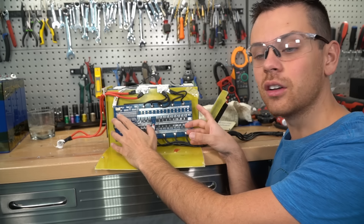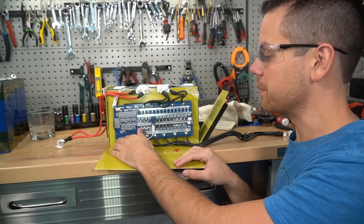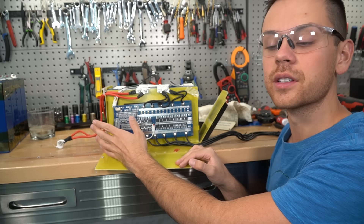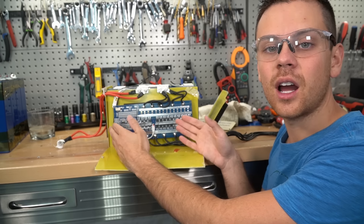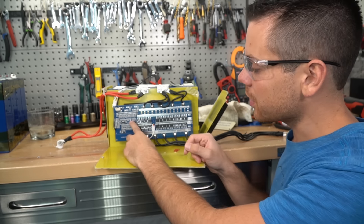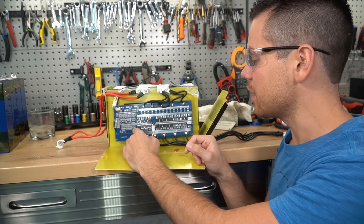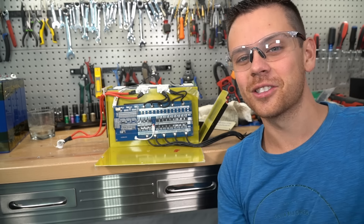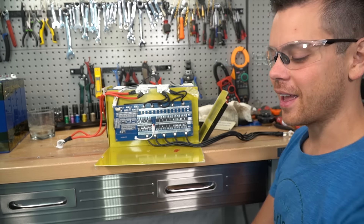It's so hard to tell who's relabeling and who's actually designing their own packs. Look at this — there's fiberboard between the cells and we have these straps holding them together, but I'm not sure who makes these cells. These are small form factor 50 amp hour cells, put into parallel and then all put into series. We should ask this company for the data sheet for this cell — I bet they'd supply it. Also, these balance leads are crimped and there's heat shrink. So everything else looks really good. This is an impressive pack.